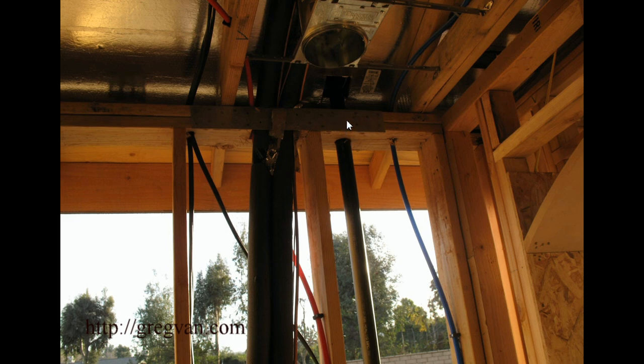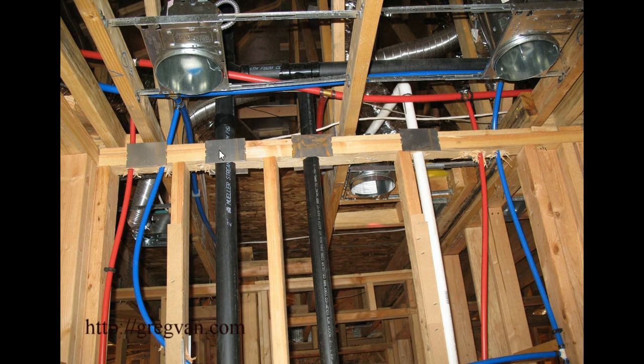You can actually drive some nails in here. And I know what you're thinking: if you're drywalling, you're not going to put any nails in here, and of course they could always mark it. That's true. But I myself witnessed one time — I was hanging drywall and someone else was nailing it — and they actually nailed through one of these straps. They put a nail into an empty hole and it went into a pipe. They drove a 4D drywall nail through a metal strap. Hard to imagine, seems impossible, but he did it.